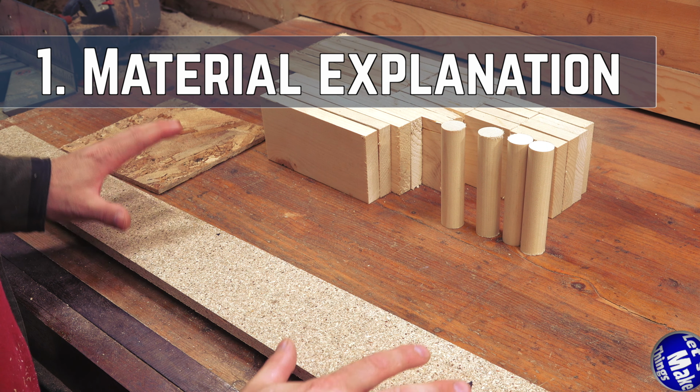Okay, now I'm going to go ahead and make the boxes with each one of these pieces. I want to make sure that they are flush on at least one side. So this bottom side here, I'm going to make sure that these 2 pieces are flush to the table. I'm going to use a longer drill bit so that I can go off the table here to drill into the holes. Obviously, you want to make sure that your drill bit is not wider than your screws.